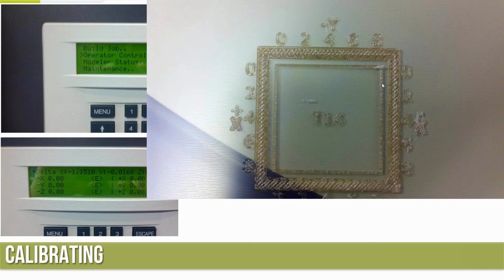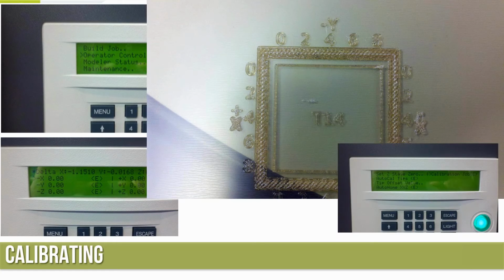and we want to shoot for the 10,000ths or 7,000ths height. I typically like to be between 10 and 10.5 for the value. Seems like that works best for me. If we do have to come back into the operator control, rerun the calibration job, we can just do that same process over and over again until we get it nice and calibrated.